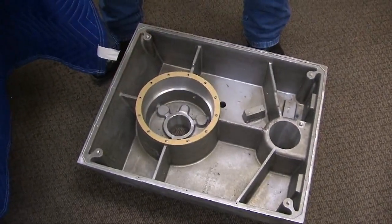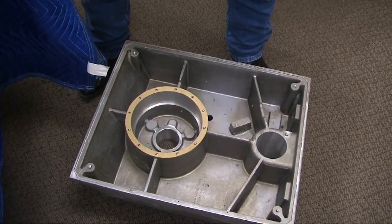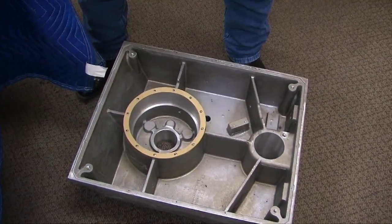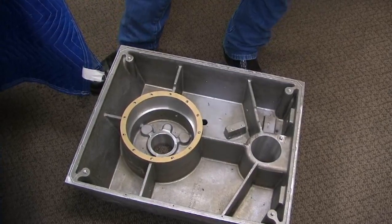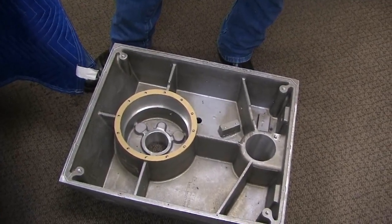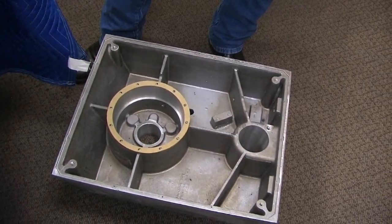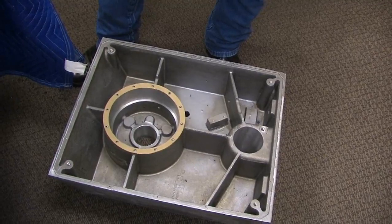You'll put that together, you'll close up the 12 bolts, and all techs know to slowly bring each one of them down until you don't cause any unevenness and pressure, and then tighten them all down. A nice good turn on each one of those 12 bolts. And that is rebuilding the piston.